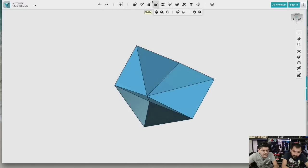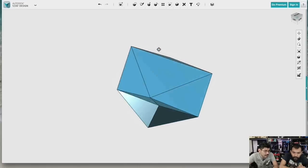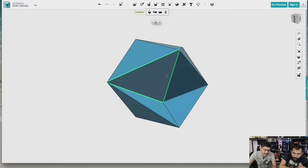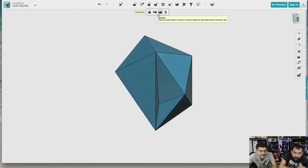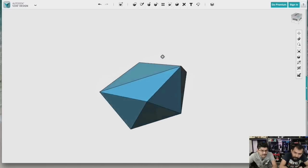Once you loft everything together, it's not quite finished. What you want to do is loft those little cavities and make sure it's fully formed, right? And you'll know it's not working when you try to duplicate it and merge them together. It'll say it can't do it. There's missing geometry. So what I'm doing here is merging it to make a full thing. You can see that's the last little bit I need. Just loft that and that, just two, and it does the third one for you already. Awesome. And that's pretty much the half of it.